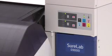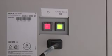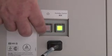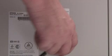I started the post-operation check. By the time I got back to the printer, the LED had gone from green to flashing to off, so SureLab is now powered off. Before we install the sorter, we want to make sure the power to the unit is completely off. I'm going to power the unit off with the power switch, turn off the humidity control, and then pull the AC plug.